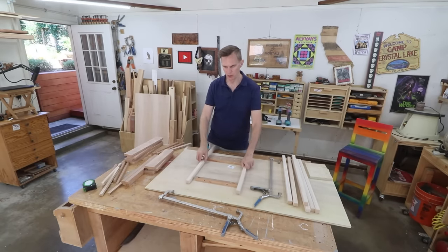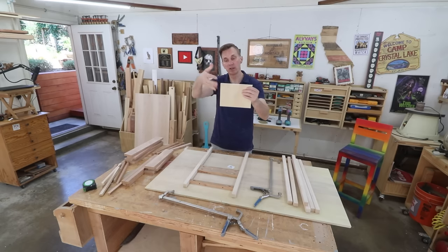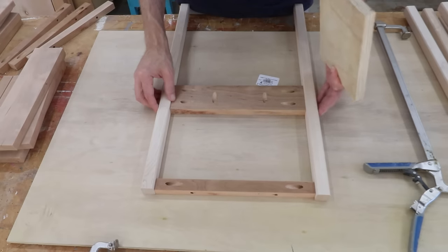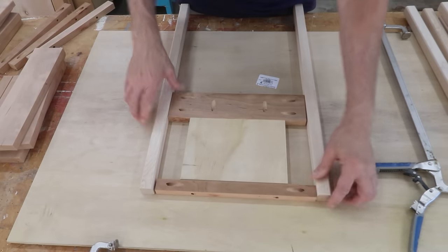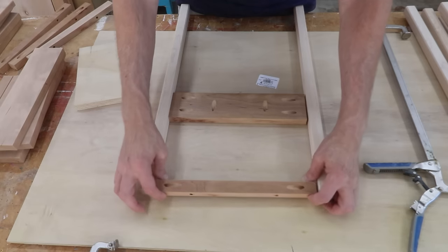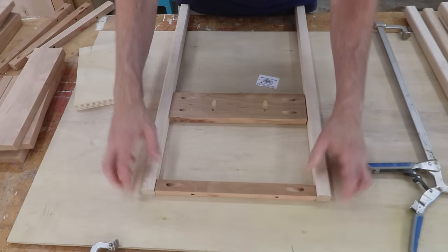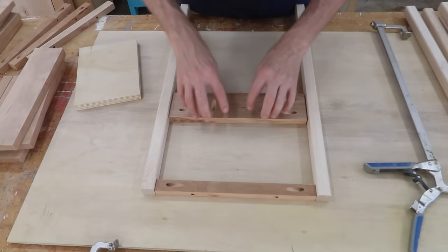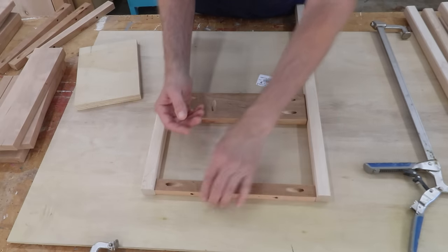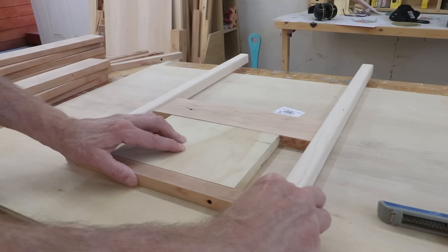The first thing I'm going to do is assemble the two sides. To help me do that I've cut out a scrap piece of plywood that's six inches wide — I can use that as a spacer to align these frame pieces and keep the distance of the top and lower frame pieces consistent on both sides. I just need to clamp this together so I can put these pocket screws in. Since the legs are one inch thick and these two pieces are three-quarters of an inch thick, I want this reveal to be on the front side. I'll clamp it up and then flip it over so I can get the screws in.